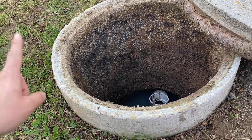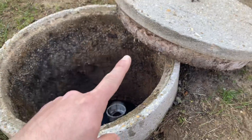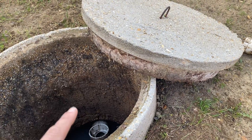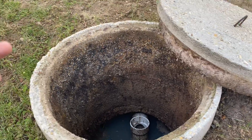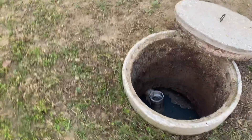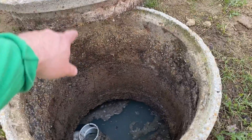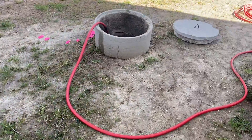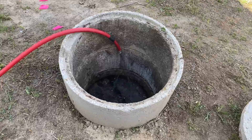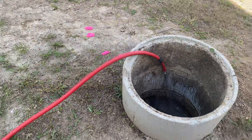I'm not a huge fan of this style of concrete lid strictly because of the bevel. Getting this kind of lid off of the riser is fairly difficult. Right here you can stand up and have plenty of room to lift it up and out of the hole, but you have to clear that three inches on the lid. On this one it's a little bit harder depending on how tall you are because you might have to lift even higher to get it up and over.